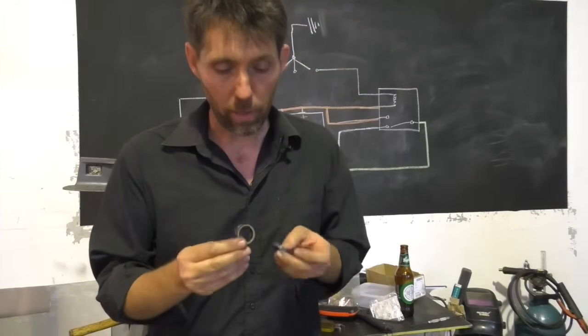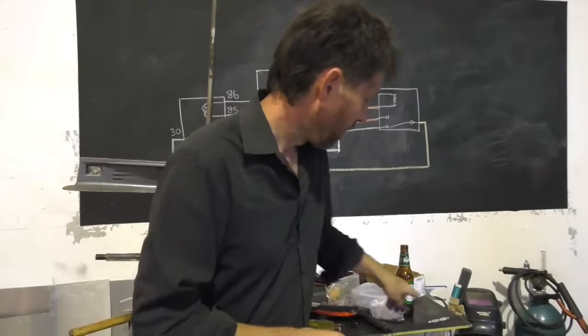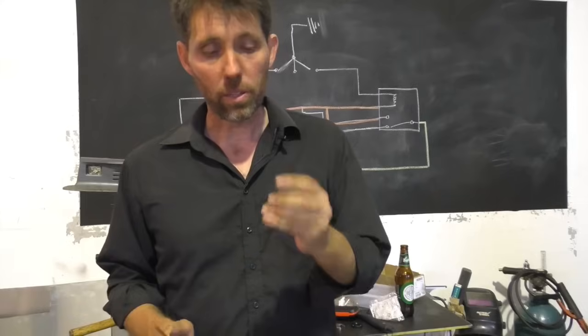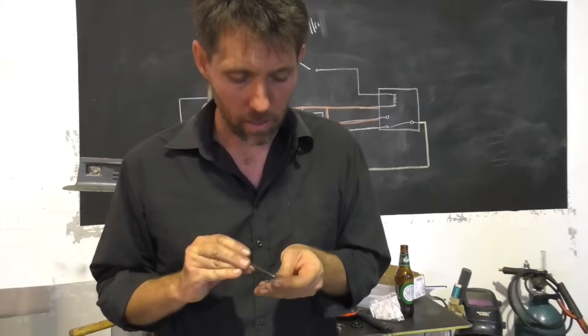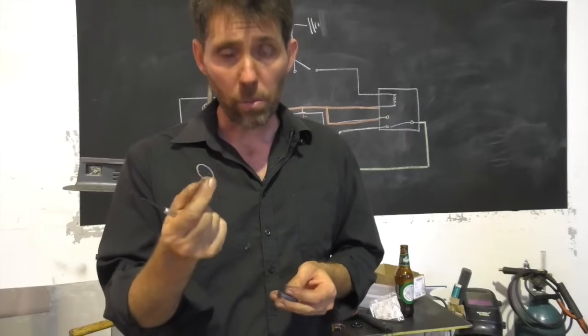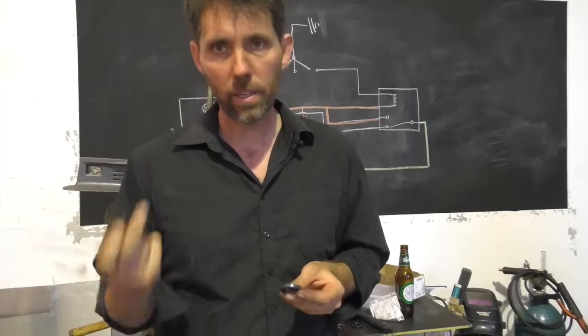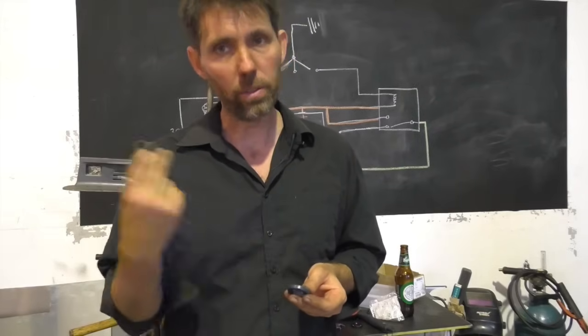And that's when I got into this style. He was also the one that pointed out this was a single lip seal and the ones he supplied were a double lip seal. But what he did say is that the spring inside these is not stainless steel. So a marine seal is always going to have a stainless steel ring inside it. He said you could use that on the oil side, but don't use it on the saltwater side.